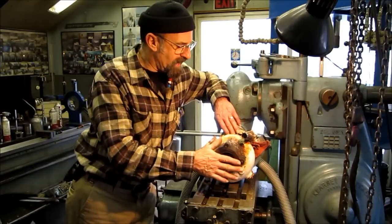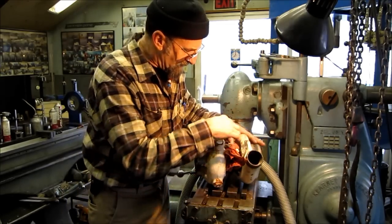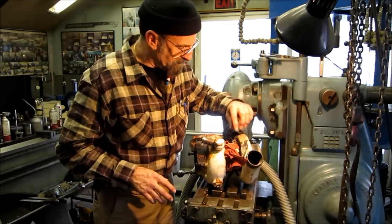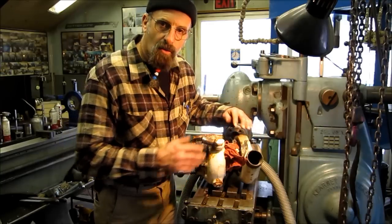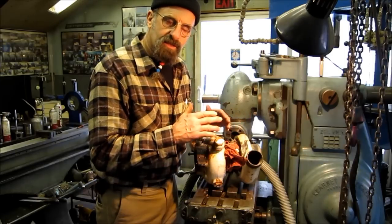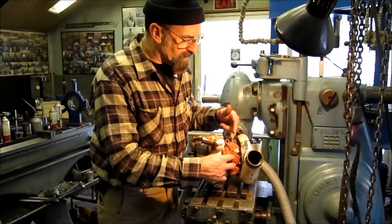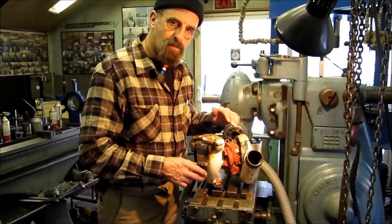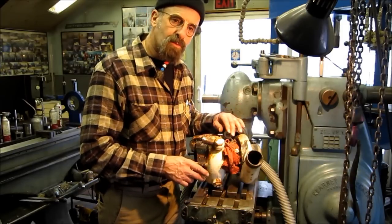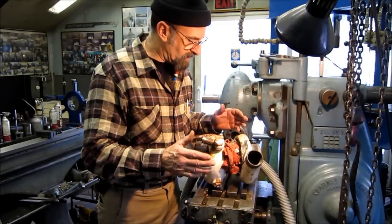And before we do that, we're actually going to go make two blanks to cover the oil ports for the turbo before we do any work. It's the most important thing. You can see that the person at least knew what he was doing. When he pulled this off, he knew he had to protect those ports from any debris in there. You get debris on your oil side of your bearings on a turbo and it's all over.